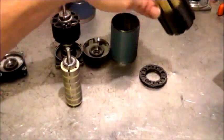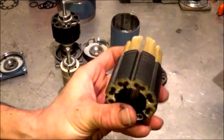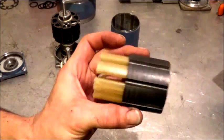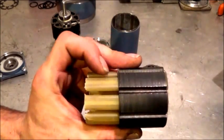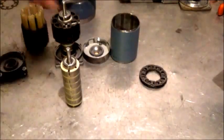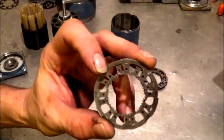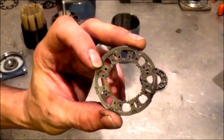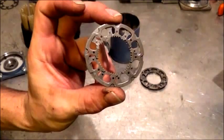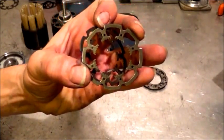You get that off-camera and it's got fiberglass or whatever material the little core is made of still left in it. I cut the edges off on either side and now I've got a bunch of laminates. You're going to want to peel each one apart. On the smaller stepper motor the laminates aren't glued together — they have little tiny recessed sections on one side and a little pin on the other. One side's recessed, the other side sticks out, and they snap together, so they're pretty easy to pull apart.